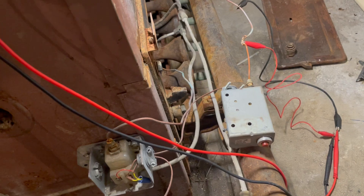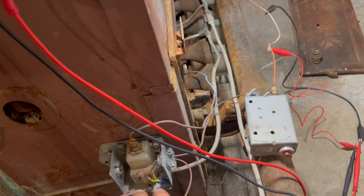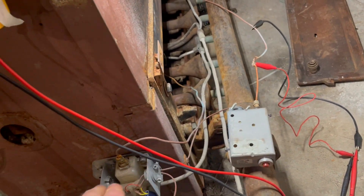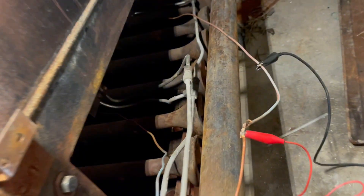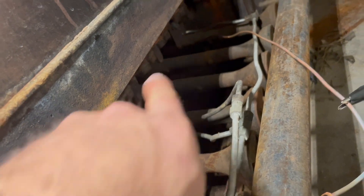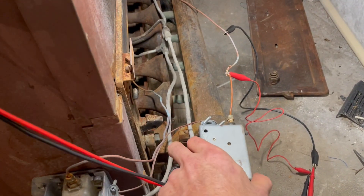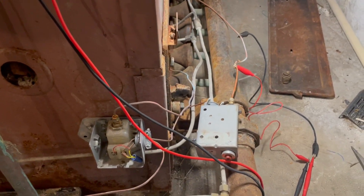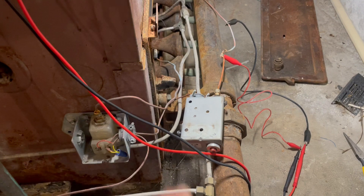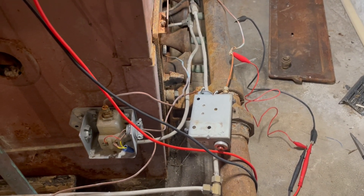The other thing that I did to test the control: I went ahead and took this thermocouple off, which killed the pilot. But I was able to use that in here and then heat the pilot with a torch and get those on. Just a few tips there for working on the old, old crusty boiler.